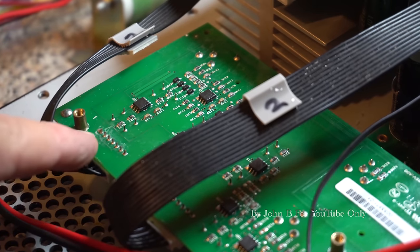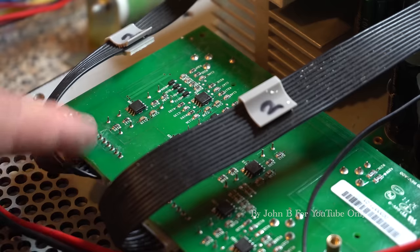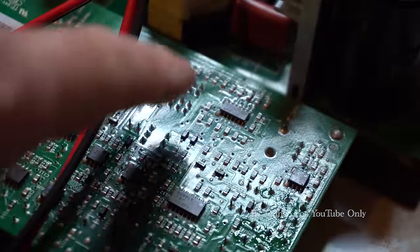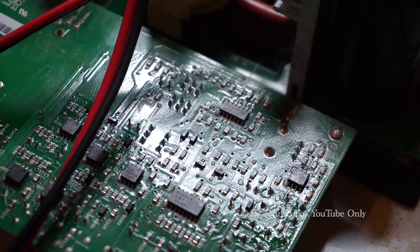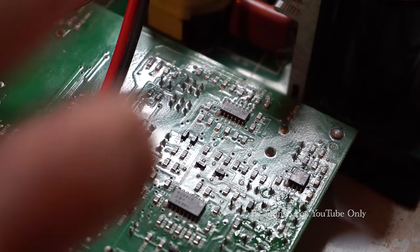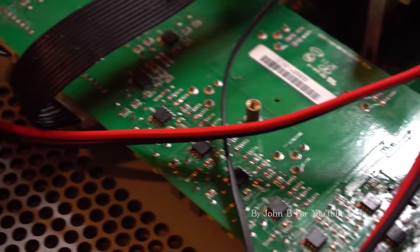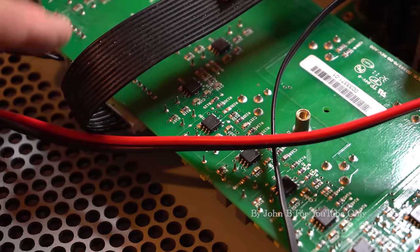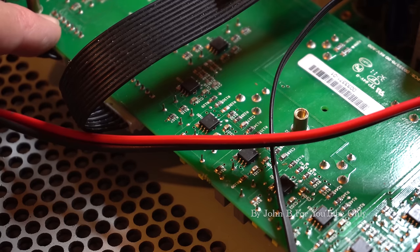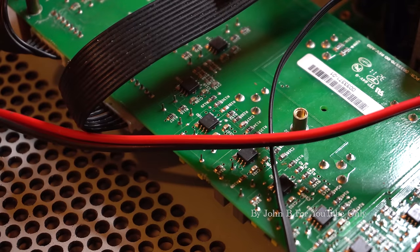On this plug, apart from the signals going in and out, for A and the B channel is just linked to the A. There's a switch down under here that just inverts the positive and negative. If you're running more than one sub, you might have a phase difference. You just split the phase, swap the phase. But over on this plug, you've also got a 75 volt sense. And although the drawing says 3.5 volts, I'm measuring 3, so it looks like this circuit won't work if it doesn't see the 75 volts, or at least part of it.